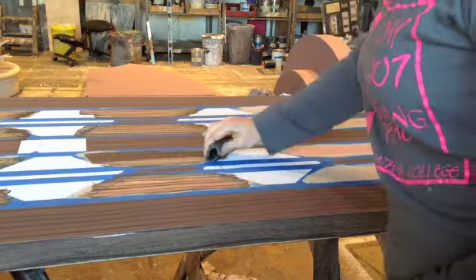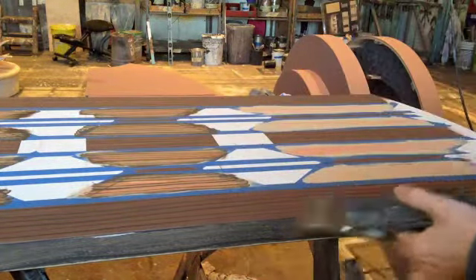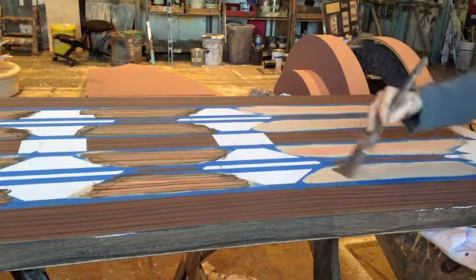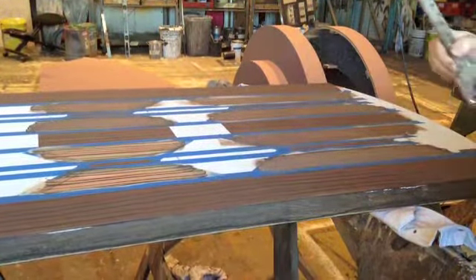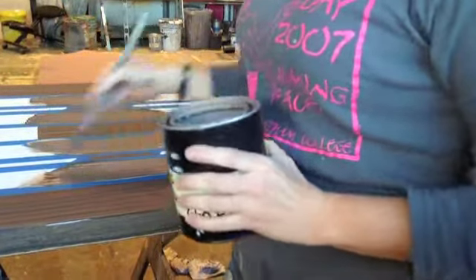For this grain, we apply a brown glaze and use a rubber tool to wipe away some of the glaze in a wood pattern — you've probably seen this technique before. The last step is to add another glaze to give the wood its final coloring. I adapted all the woods to use the same technique with different final glazes for simplicity.